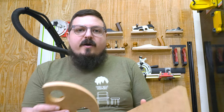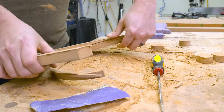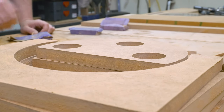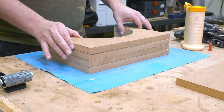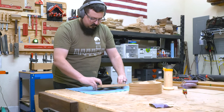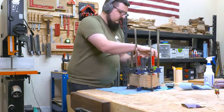They've got some pretty rough edges, so I'm going to clean them up and then start gluing and sandwiching them together. The templates were looking a little rough because I didn't have the depth of the bit set low enough on the first pass. After sanding them down I could stack and glue them together using Titebond 2 along with a brayer to spread out the glue. I check the edges to make sure they're pretty close — they don't need to be perfect. A couple of clamps squeeze the pieces together while the glue dries. For the interior curve it's best to only apply glue to one side; if you apply glue to both sides it can get excessive and the pieces slide a lot.